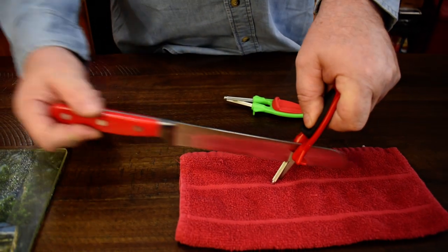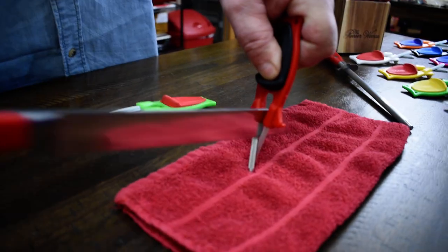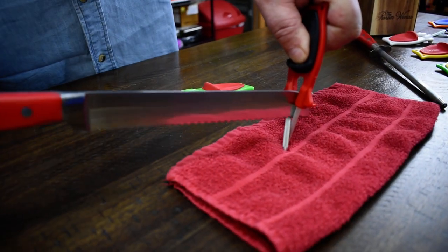Roll them in the middle. On this side it makes it vibrate and chatter through the teeth — you're hitting one side of the tooth going in and the backside coming out.